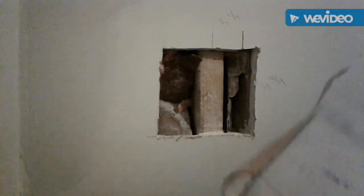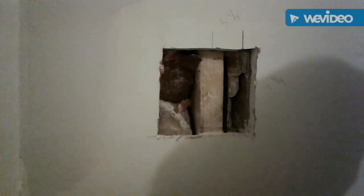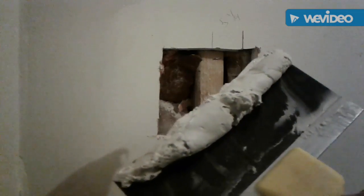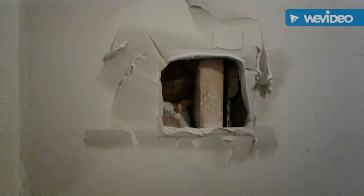All right. Now for our first holder patch, it'll be this one. Get a little adjustment there. There we go. So now it's just like I showed you before. You've seen how I cut out the squares like that. Now, I'm gonna take this here mud, scoop up a little bit here, see how I got it? And I'm not scared with it, can't be. I line the inside a little bit with it and around the edges. So that way that tape and that extra piece of drywall got something to hold on to.